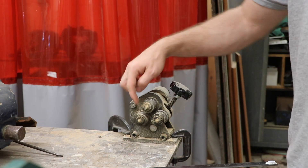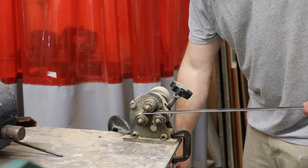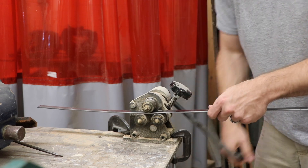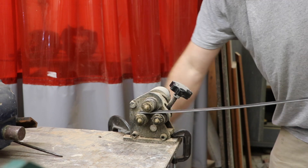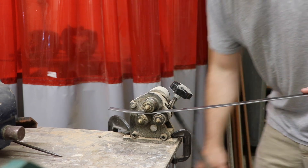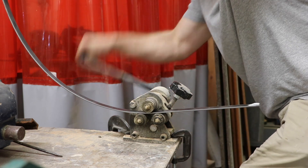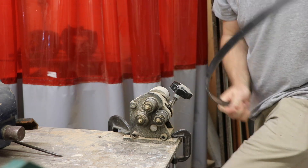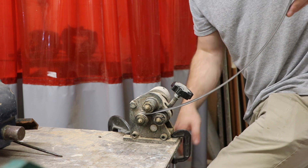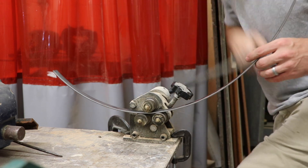I have a real simple little setup here — I have a ring turner, or slip roll over there, but this one works best for me for tension hoops and stuff. It's just a lot of passes through here and it will slowly start to bend and go around. This one's set real low right now — you can see that's making an arc. So now I'll just run through it until it fits exactly what I need, a little quarter turn at a time. I could do this all at once with a heavy pass, but I like doing lighter passes — it's less stress on the tool and on everything, and it doesn't take too long.